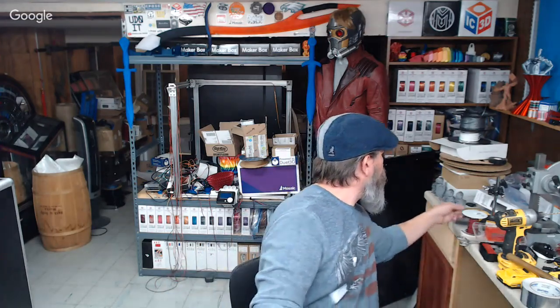With this one here, just to make sure I didn't do any damage, one of the first things I did was I put the belt down, I homed everything, and I laid a piece of, like, 400 grit sandpaper, and I had it run the whole length across it once, just to put a slight flat on the bottom of the nozzle where it's going to go across the bed, so you don't have that edge. Hopefully to keep that edge from hitting the bed. You say you ground the bottom of it.